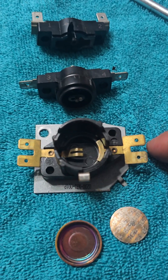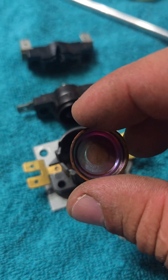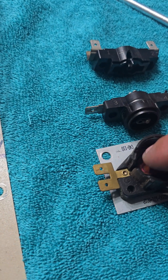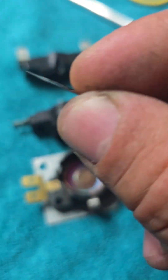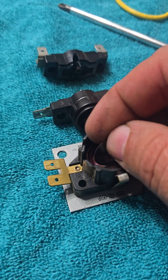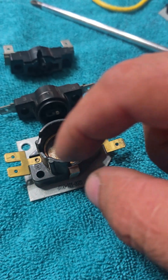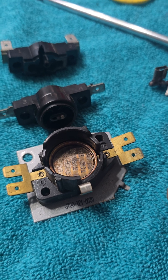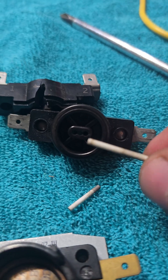You apply 24 volts on the two brass terminals and as you can see, they're not connected inside. This little heat cup actually sits down on there — it's a resistive material, so it doesn't create a dead short, but it will start generating heat. Here is a little snap disc — it sits on that, it's like an upside-down bowl. It's like one of those little metal lids you can snap — it flexes. It normally sits up here like an upside-down bowl, with just the outside edges touching the plate. When you apply electricity here and here, it's going to heat up that outer ring and make that little disc snap so that instead of being an upside-down bowl, it becomes a right-side-up bowl.